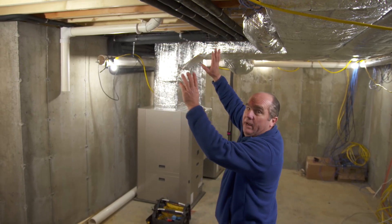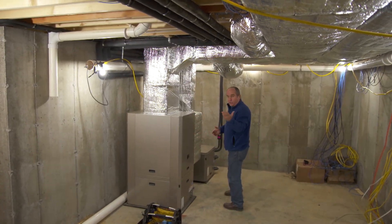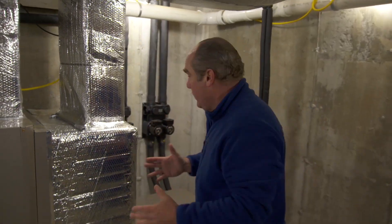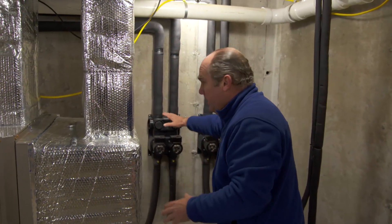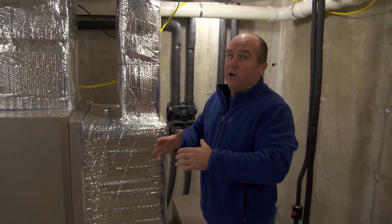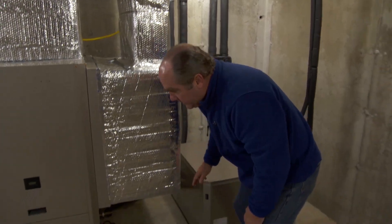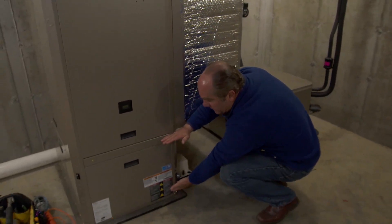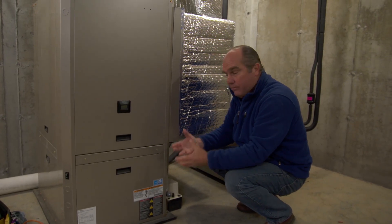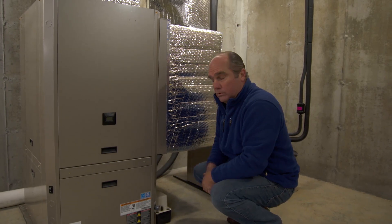You can see right here are two pairs of lines that come from our wells to our mechanical space. We have two wells - one's 450 feet deep and the other is 300. The larger well is going to connect to our first floor geothermal heat pump. The first floor has a lot more space to be heated or cooled so the unit is bigger. The bottom section is the actual heat pump itself, which will extract energy from the ground to heat the building, or take heat out of the building and dump it to the ground to cool it.